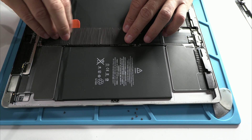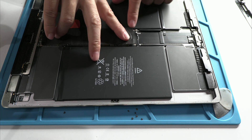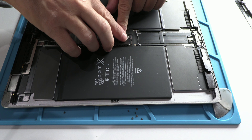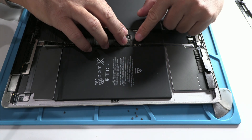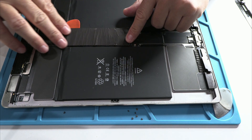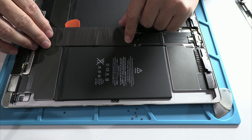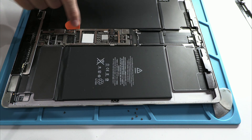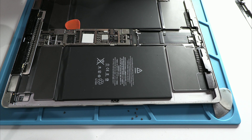This is Apple's trick, and it's where much of the problem lies. To disconnect the battery connector, you first have to remove this protection, then disassemble all the screws, and finally insert a pick or plastic card to separate the battery from the motherboard. Here's the critical part: during this entire process, the screen must remain connected.